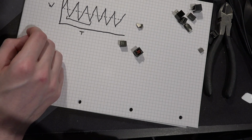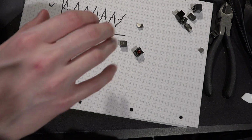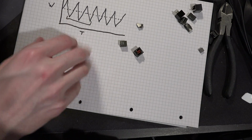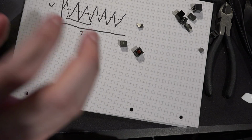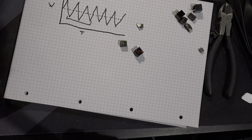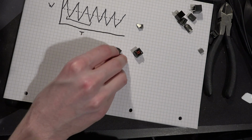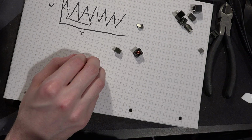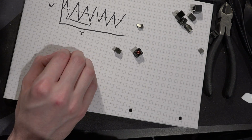So if you're going to be doing this, be accurate so that you only hit the inductors, and then you're going to have to wait for it to dry, check that everything dried the way it should have, and then reassemble the card, right? Don't do it really quickly. I get that this really sucks and it's a pretty half-baked solution. I'm pretty sure you're also going to lose your warranty if you do that, because good luck removing all of the gunk you've just applied to the inductors.